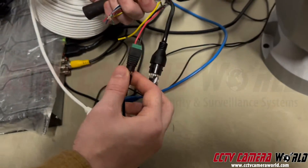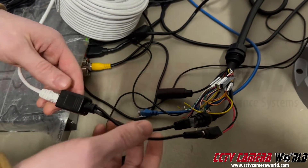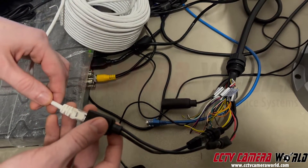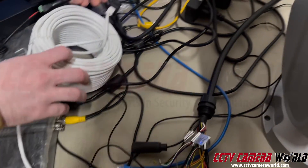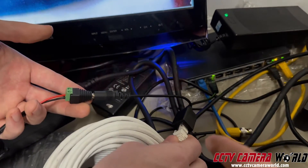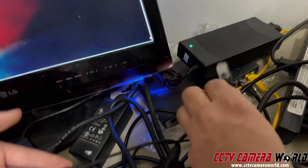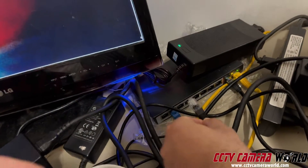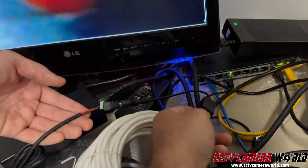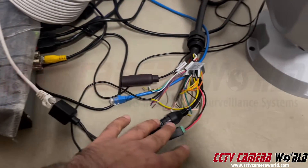What I'm doing here is connecting them to a PoE adapter. This is a very basic thing — all it does is let you combine power and data on one side, mix it inside your network cable, and then separate it on the other end. The power supply connects to the DC connection, and the network connector — a regular RJ45 plug — goes straight into my switch on my router. It's data only, no PoE. Power right here mixes the two together and sends it over my CAT6 cable, and then the other side separates it back out into DC current and network connection.